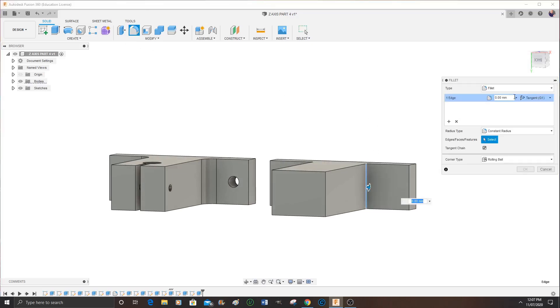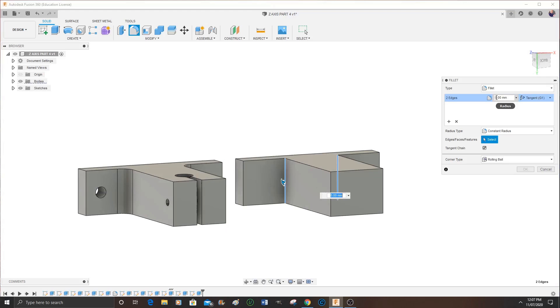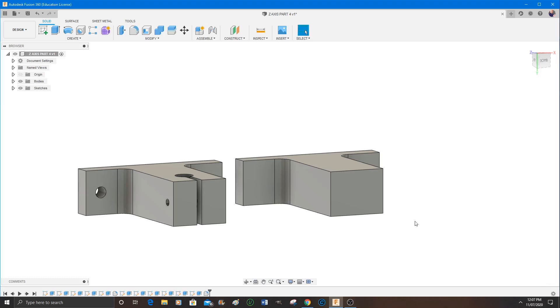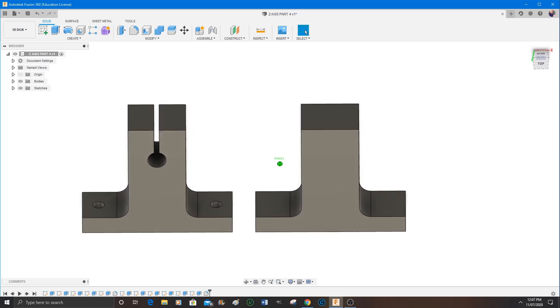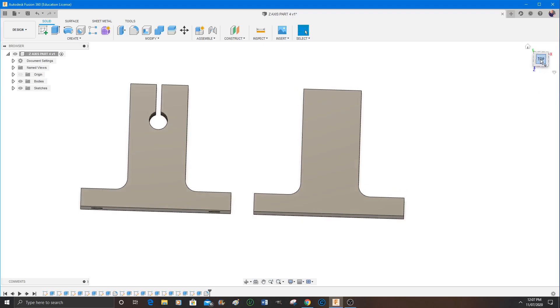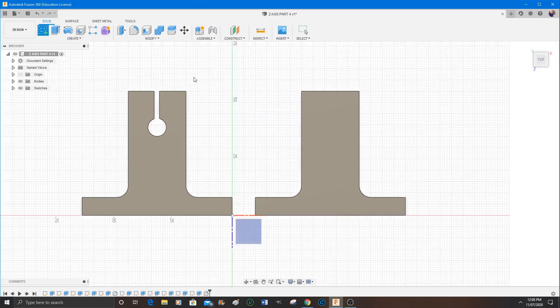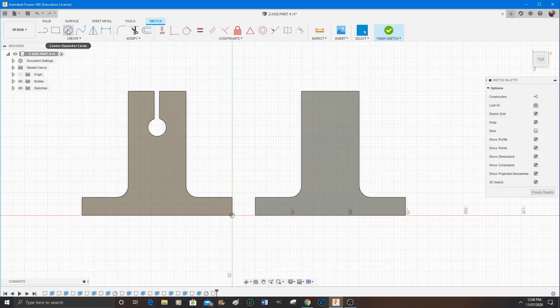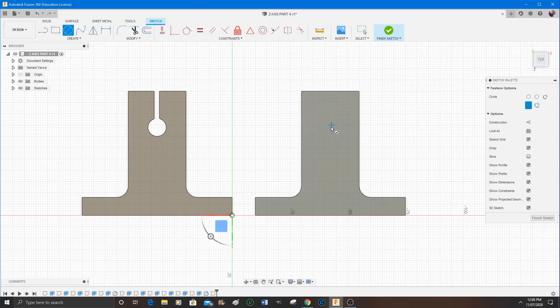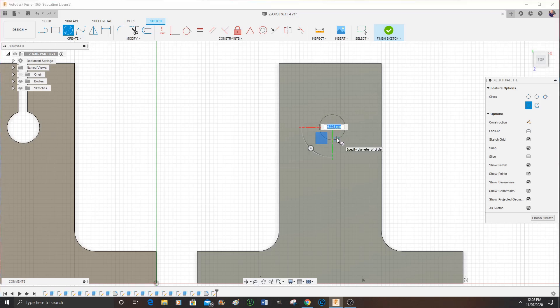Just a little pan around to make sure everything's right. Now I'm going to put a small fillet in here — especially when you're working with something like a bracket made of plastic, it strengthens the area a lot. It's a five millimeter fillet and it stops the area flexing or even breaking. It's not under a great deal of stress, but certainly under some stress.